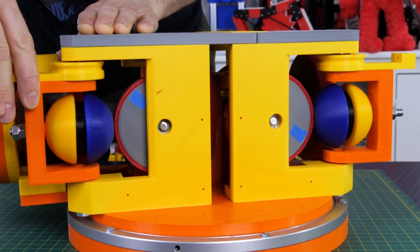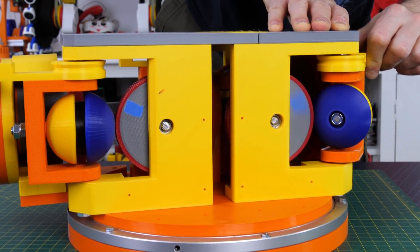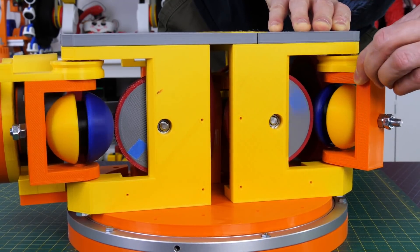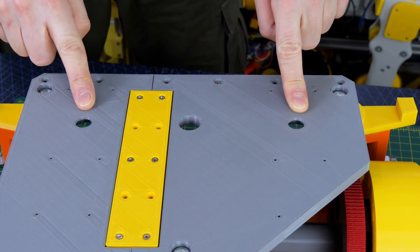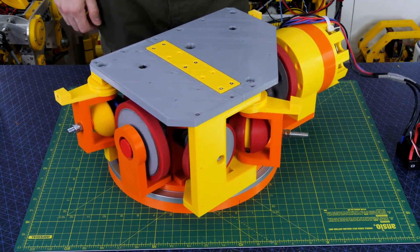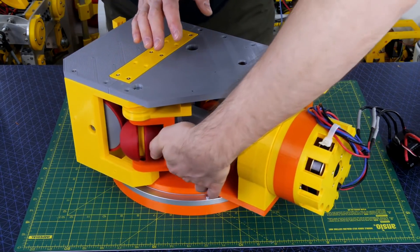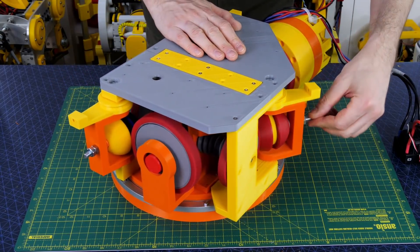If I tilt it the other way they're going to reverse. That is of course true for both ends, and these two are going to drive the robot arm shoulder and elbow for a differential drive system which I'm going to build in the future. You can see we can vary the speed and vary the direction and we've got an off position in the middle. Those are going to drive two vertical axes. The third one, if I clutch it, will actually go and drive the whole base around in either direction - I can vary the speed and vary the direction, and of course it's locked in the middle with that worm gear so when it's in the central dead spot position it doesn't drive the worm gear and the whole mechanism can't be back driven.